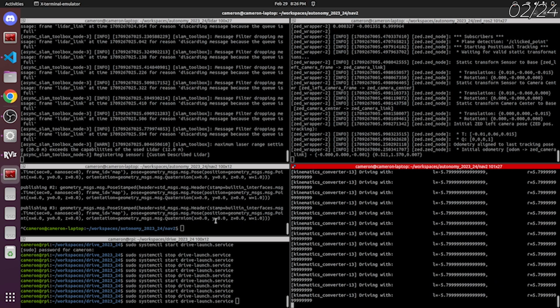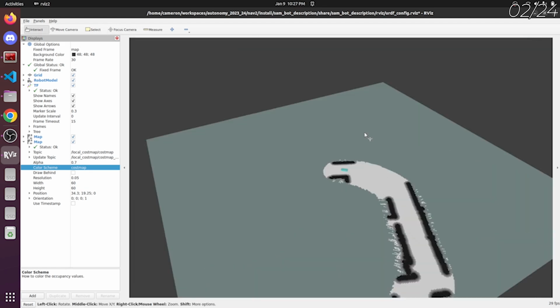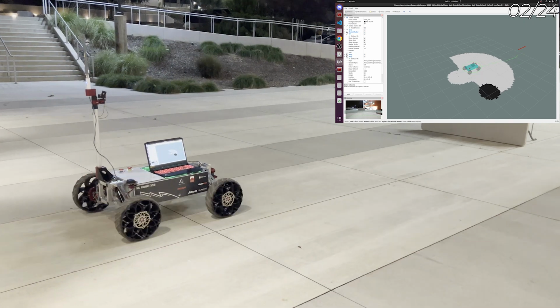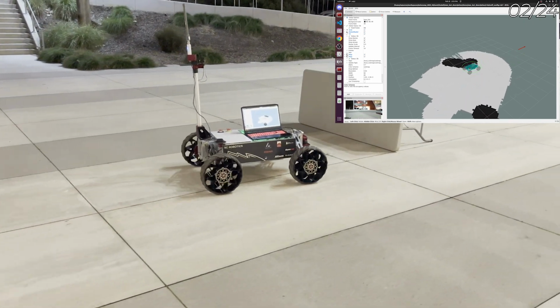Precise localization is achieved through a sensor fusion approach consisting of input from wheel encoders, visual inertial odometry, and high-precision GNSS positioning and heading, augmented by real-time kinematics. The navigation server uses fused odometry estimates as well as obstacle data provided by LiDAR and stereo camera point clouds to generate a cost map.